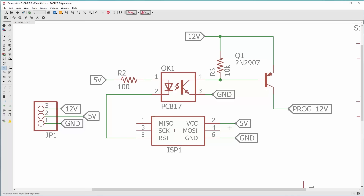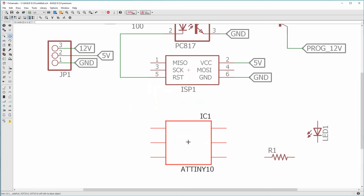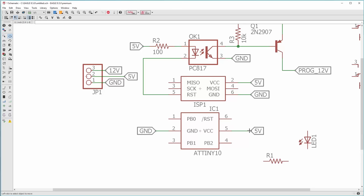The reason we hook up voltage to the VCC line is because if the programmer does not see the correct operating range, it will not program. Let's bring our microcontroller down here and connect ground and power. Eagle is a really noisy program — bling, bling, bling.